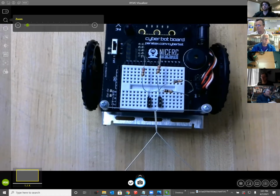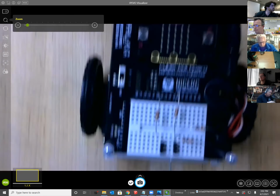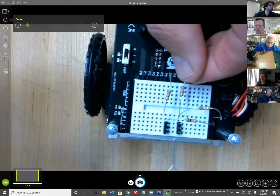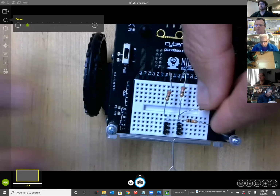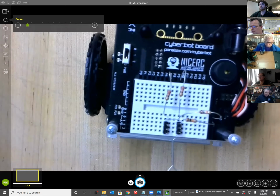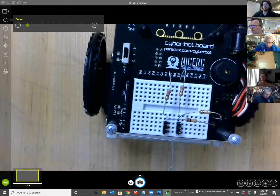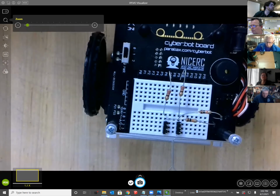Okay. Probably. Did you copy and paste our code? Yes, I did. Okay. Likely it's, we'll see if others observe that, but maybe a wiring error. Maybe give it a close look to make sure they're not touching each other there. Yeah, you might have either the resistors going to the 5-volt might be touching the resistors going to the IO pins.